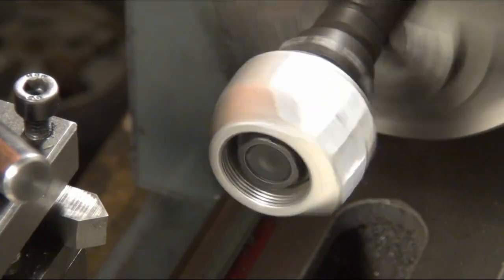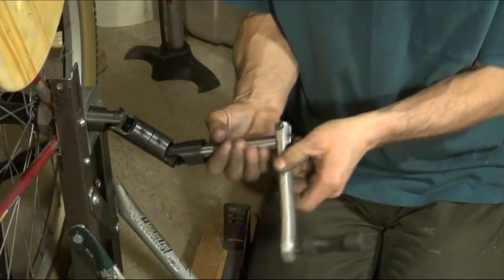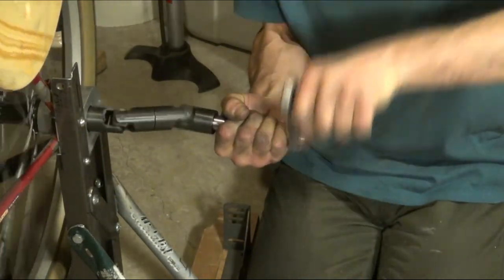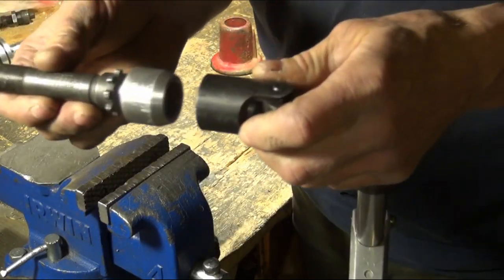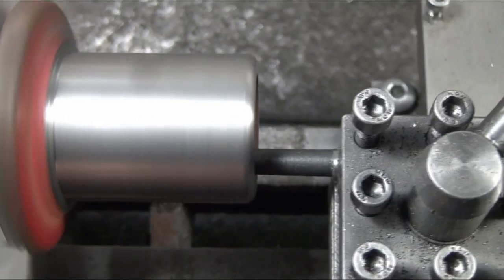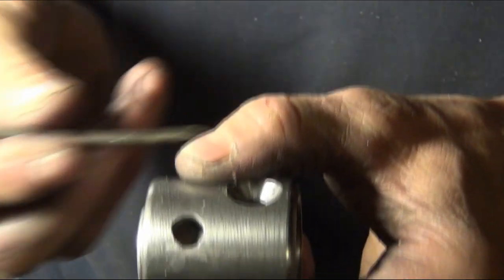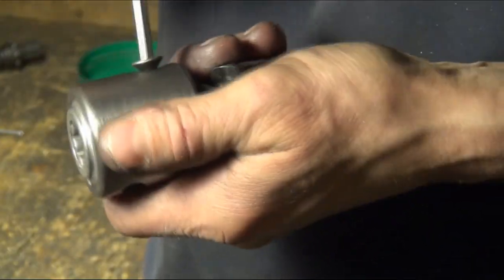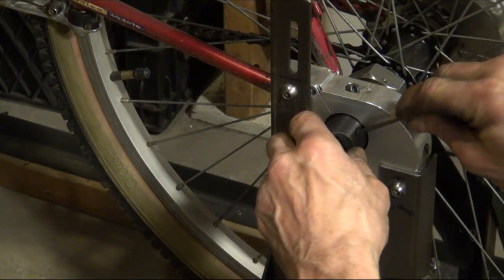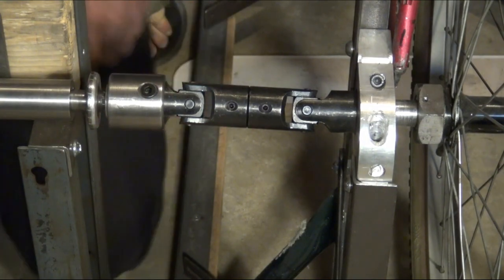Its matching crank arm became the female half of the coupling. This joins to the chop unit through a pair of purchased universal joints, which together form a double cardan joint, and can accommodate a lot of sloppy alignment between the pedal drive and the chop unit. One of the universal joints was fitted to the female coupling with a sleeve made from a found barbell collar. I pinned the female coupling in with some nail bits, then screwed the universal joint to the sleeve with bolt holes that I had drilled and tapped. The couplings easily join and separate.